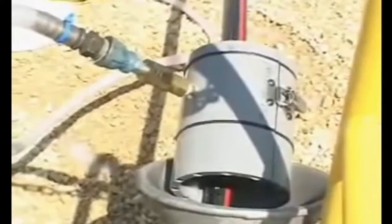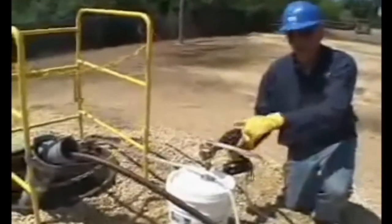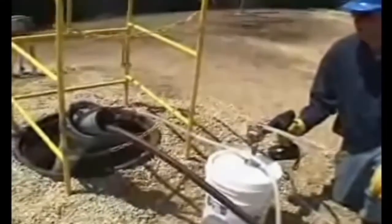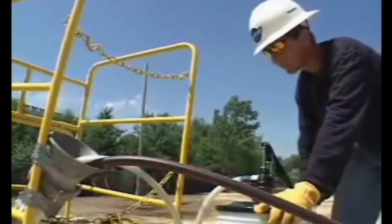An extension feeder tube allows the LPD5 to draw from a five-gallon pail or 55-gallon drum. The pump is supplied with a 12-foot output hose. Vary the drill speed to control the lubricant flow rate from the LPD5. When finished, reverse the drill to return the majority of lubricant from the output hose to the bucket. An appropriate lubricant pumping rate depends on duct size, cable count, and pulling speed. Even for large conduits, pumping rates required are generally less than one-third gallon per minute. Pump the required lubricant volume at a rate that evenly distributes the lubricant over the length of the cable. A slightly heavier coating is recommended for the first third of the pull. If a pump is not going to be used for a while, clean it by pumping through water before storing.